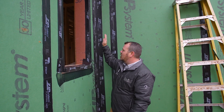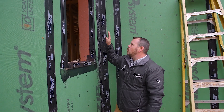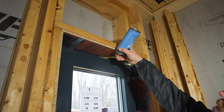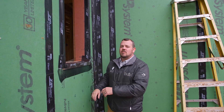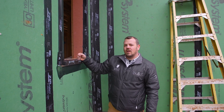Everything is connecting our wall sheathing with our jam sheathing. Once we tape our window to this opening on the outside on three sides, we can then air seal to the interior and make those connections very simply, so that we have air-managed and water-managed window installations. This is super simple — we didn't have to have any specialty tools, and this window in particular our least experienced carpenter took care of by herself.